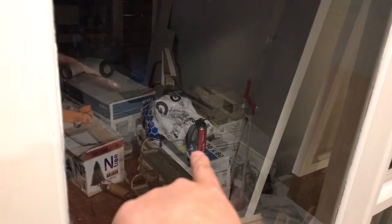But there's still some porous surface which hasn't been fully covered by the first coat of epoxy, so there's still a bit of bubble. Now you cannot see it, but before there was a bit of bubble. Once there are bubbles, what I do is use a heat gun. There's the heat gun, that one.